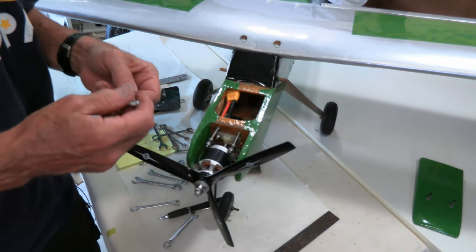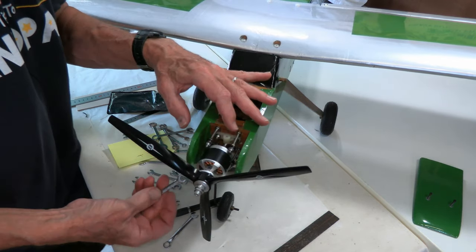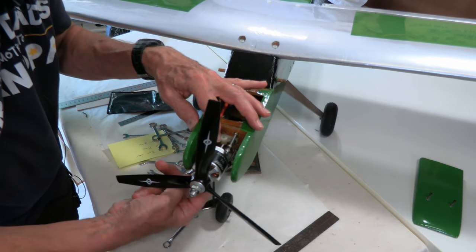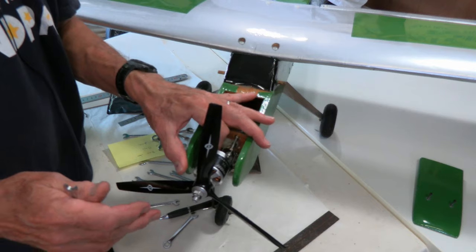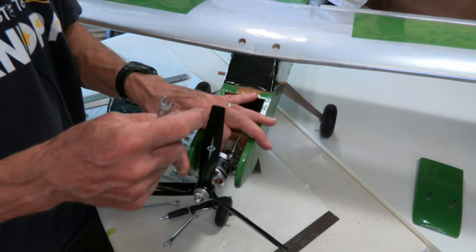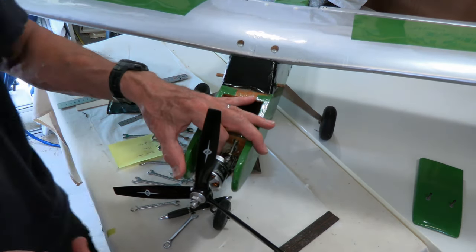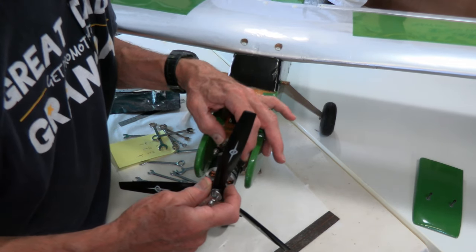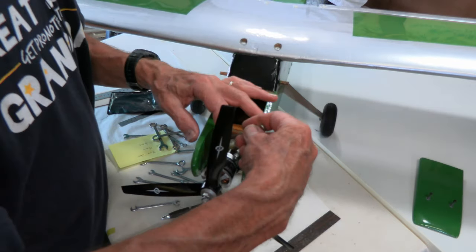Looking at what's happening with the motor, it looks like I need to go a lot farther. I'm also keeping an eye on my clearance back here. At some point we'll start moving the other ones, but in the meantime it gives us another reference point. When actually tightening up, we're going to tighten three of them, because three points define the position. Then the fourth one we'll alternate between front and back as necessary to get it to tighten up without moving the motor — it's just there supporting it, while the other three define the position. So that's got only the slightest bit of right-hand offset.